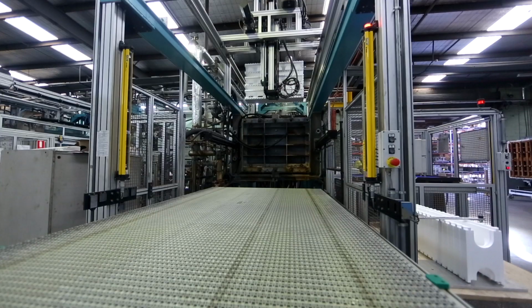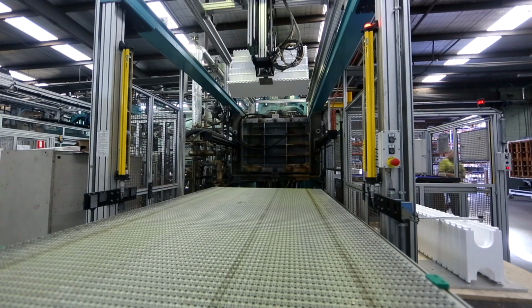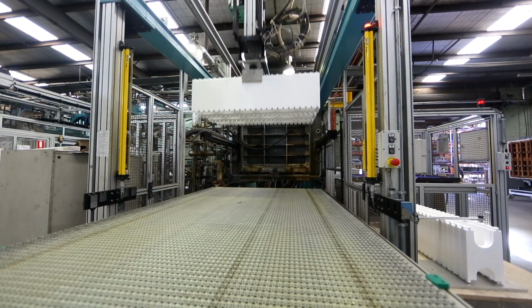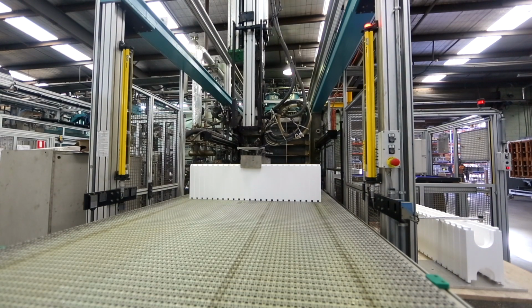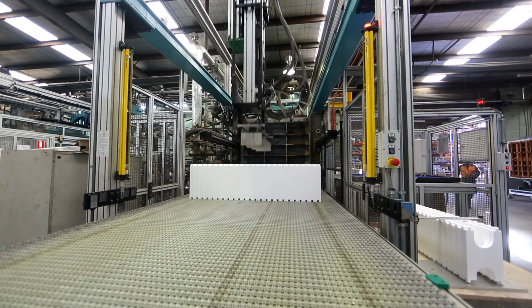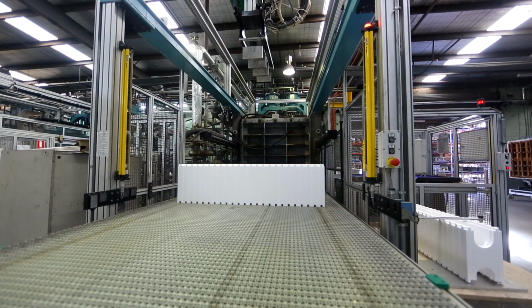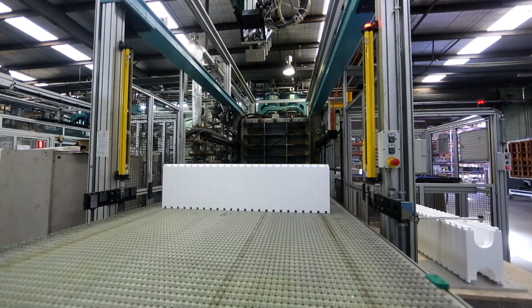It's with good sense these blocks are so highly engineered, because with so many tonnes of wet concrete being poured into them so quickly, containing this weight long enough until the concrete cures is essential. So essentially we are building a concrete home, but with the benefits of having polystyrene like an Esky either side to protect us from heat and sound.